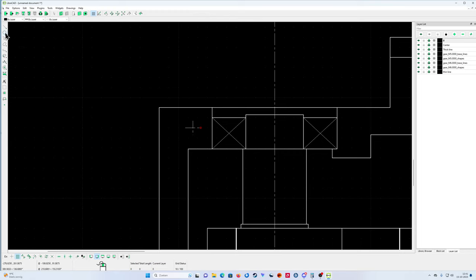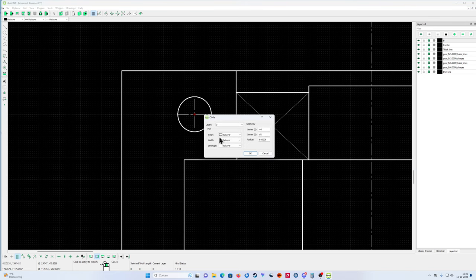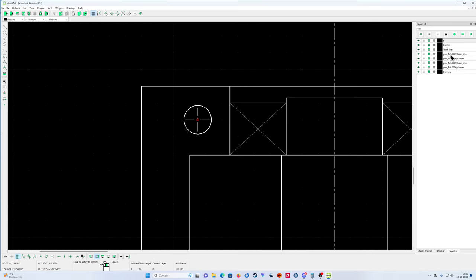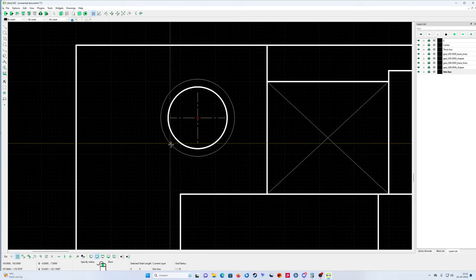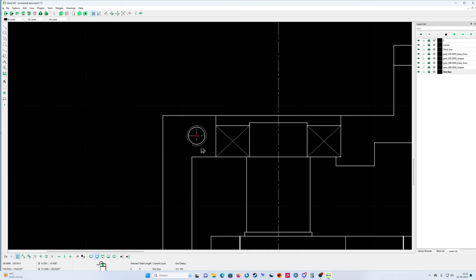So let's use, put one in here. Properties, then you say, okay, you know what? The thread hole is 18. So it's, let's say 8.5. It is 17 then, yeah, 8.5. Okay, now I'm gonna select the thin line, and I'm gonna do the same as I did earlier also with the center point angles. So like this, like that, yeah, that's how you draw an M20 thread bar.